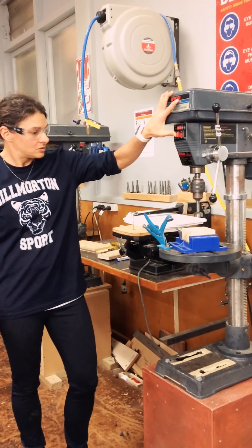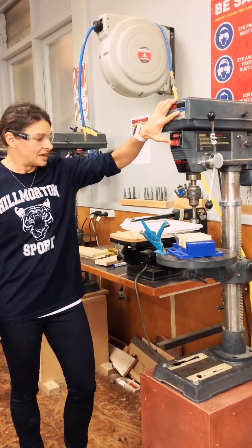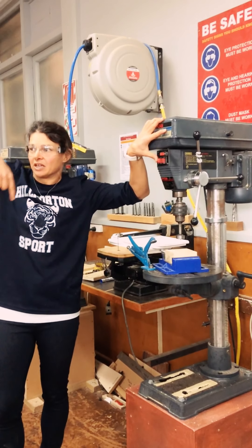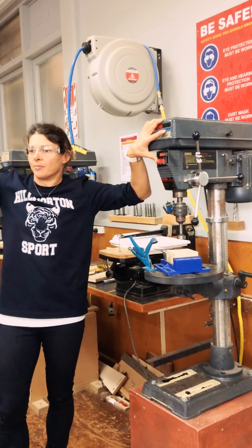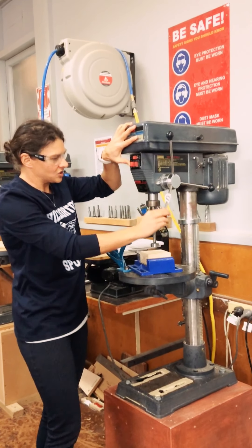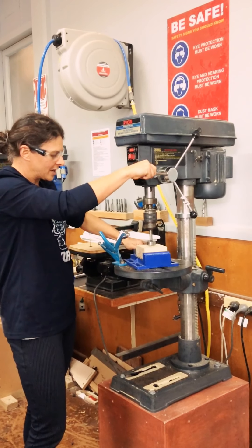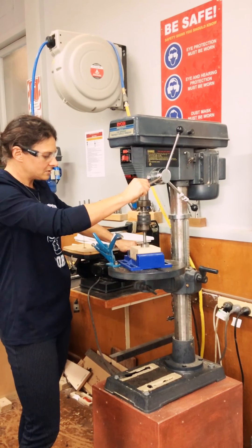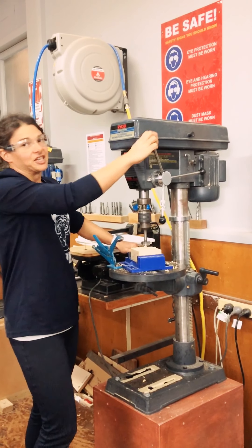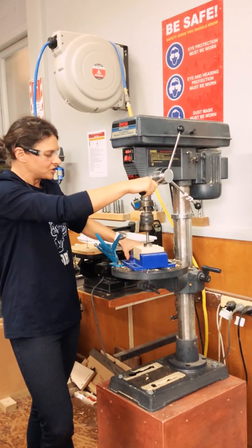Machine on. It doesn't hurt to do a test spin and check we've got that tool in right, although we did. And then literally I'm going to wind it down. If you think about it, the outside of that is actually spinning much quicker than it would be if it was a drill bit on the inside, because of its size. So I'm just going to allow it to take its time as I come down — let it get up to full speed. Occasionally I come back out of the work, just to let any material clear and to give it a little bit of time to cool down.